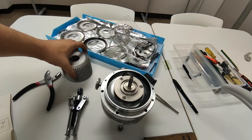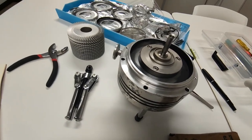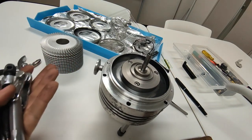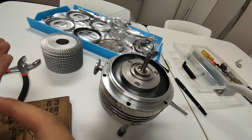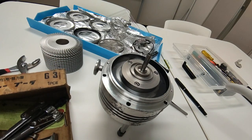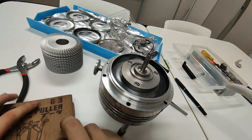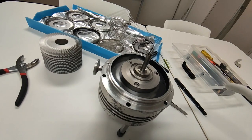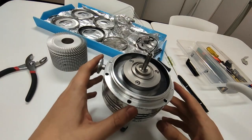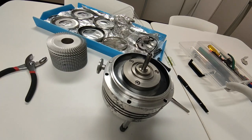Here you go — just remove it completely by lifting and here it is: the turbine assembly. Keep it really carefully. If you bend one of the blades, the game is over — you won't be putting that pump back together again anytime soon. Now I can use this puller to pull bearings from the inside as well, which is good for really small bearings. It was a pretty rough attempt at making a gear puller — use it as a bad example of how you can improvise, but don't copy it.